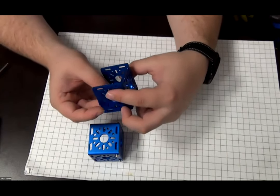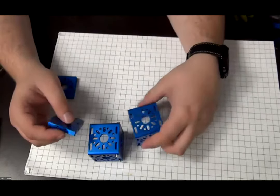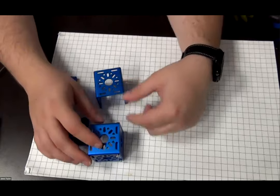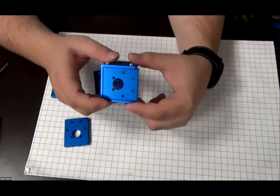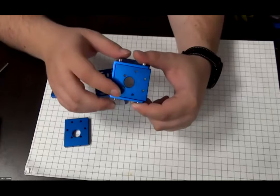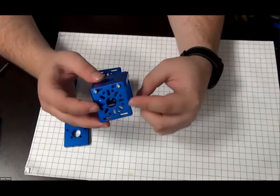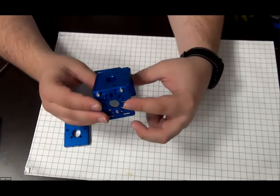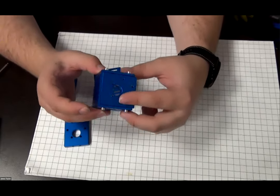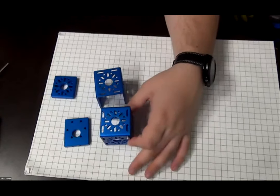Okay, so you can pull all that stuff out and get started, and you'll see that I'm just using 4 socket head cap screws to fix those in. M3 by 8. Yep, M3 by 8 millimeter. There's no need to use the 10 millimeter here. They're just going to be too long, and they might not seat properly. Okay. All right. So we'll let you get your stuff together.